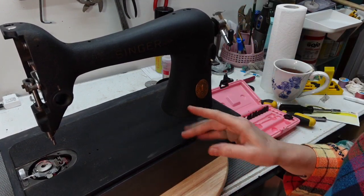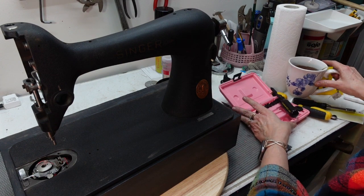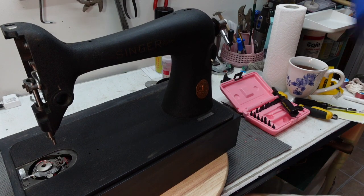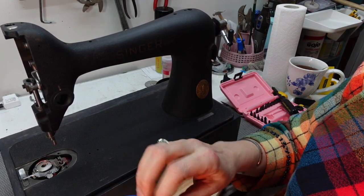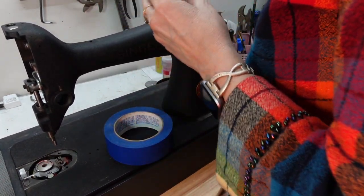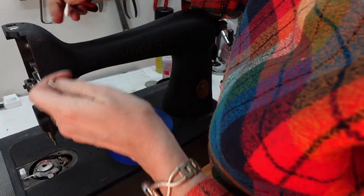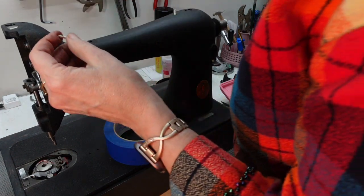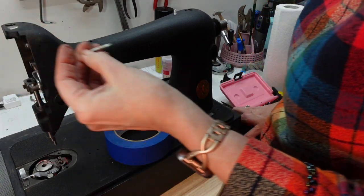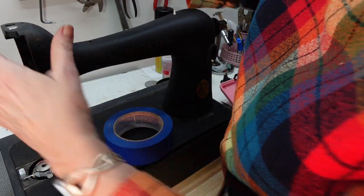The paint I'm going to be using actually hasn't arrived yet — it's set to be delivered in a couple days. So I want to get this done so that when it gets here, I can go straight out to the painting room. For the oil points up on top, what I'm going to do is clip off a piece of Q-tip. Some of the oil holes are too small and will need other treatment, but for the ones that a Q-tip head will fit into, I'll be putting that in.